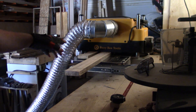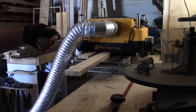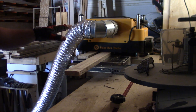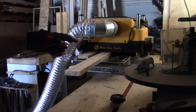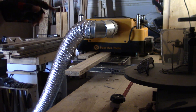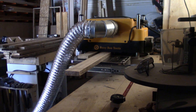I was pushing it a little bit hard — it's doing 96 cuts an inch and it was taking off almost 3/32 of an inch at a time. So it makes sense that it would blow the breaker. Overall I am very happy with how this worked out. I'm going to lift that up, throw the breaker back on, and drop the speed back down to half where it was for the first bunch of cuts, and then I just switched it over.